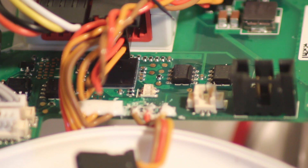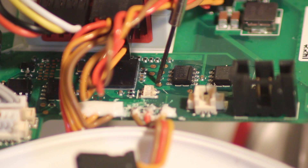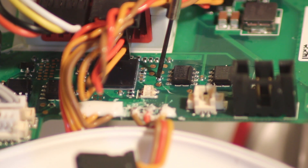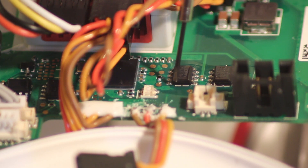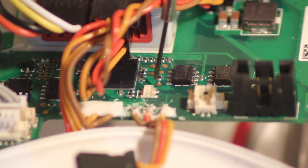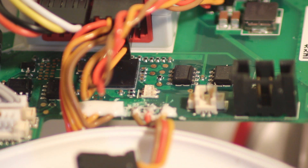The next two connections are the two little gold plates - one is there, and then there's a little PCB module separating it, and the one just past that. So those two gold plates - this one and this one. What we're going to do is a little tiny solder joint onto both of those, and then connect two wires to that. That gives us the four wires that make up a CAN bus port.